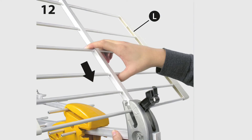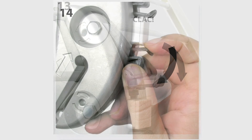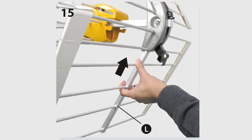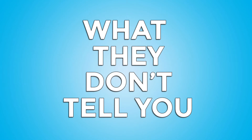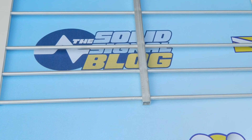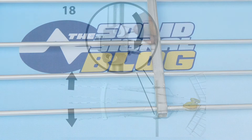Now they're going to have you assemble the reflectors, which go in the back. You push them in making sure that they fit nice and securely. Push the black plastic part down firmly until you actually get a little click — or as they like to say, clack. It's the same thing with the bottom reflector: you've got to make sure it's pulled down and open, slide the reflector in and lock it in place. What they don't tell you is that the reflectors have two poles that are closer than everything else. See how the two poles at the bottom are spaced closer than the ones above them? Those are the two that need to be closest to the center of the antenna.